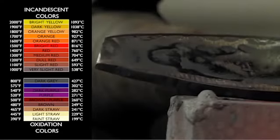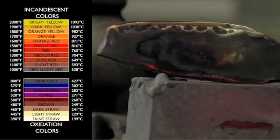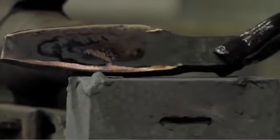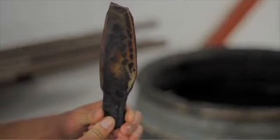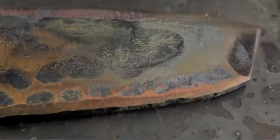As the steel is heated, an oxide layer actually forms on the surface. Its thickness, and thus the interference color as light is reflected, is a function of temperature. So you can actually see the temperature at which each portion of the steel is being heated to. Once the tempered steel turns gray, the blacksmith knows that the critical temperature is being surpassed and needs to stop. It should never go above the critical temperature because it will enter the annealing heat stages again, and thus relax or spread the molecules out too much.